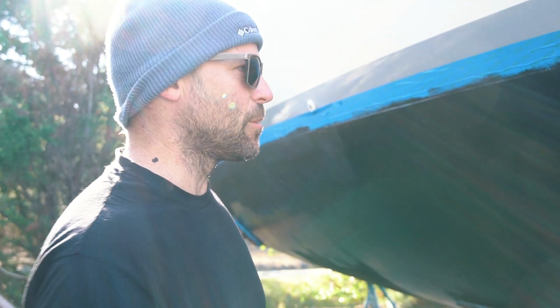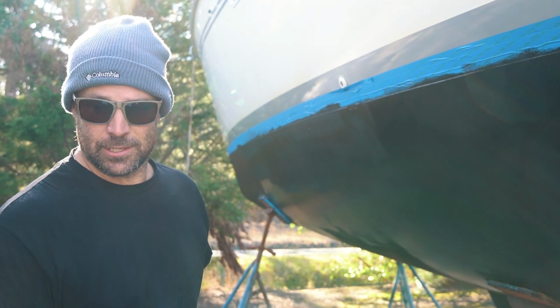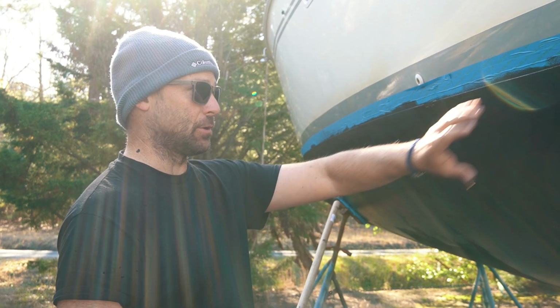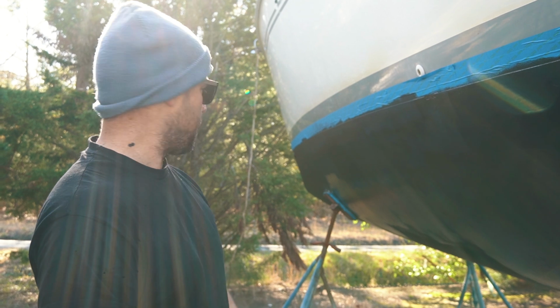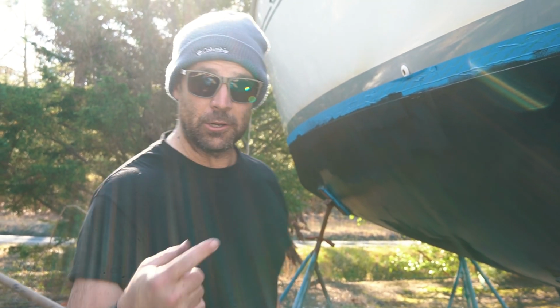What is this, day 4 on the hard? We are putting our final coat of paint on. This is the Cadence HRT unepoxy. Kind of makes a third coat around the waterline, second coat on the keel and rudder, second coat on the bow. We're painting our chain. You want to come see this?